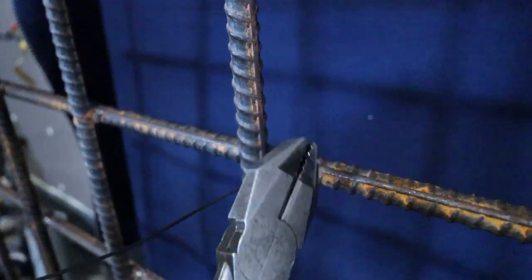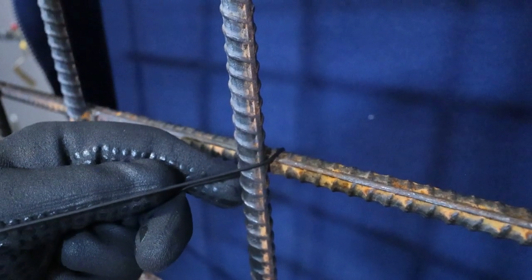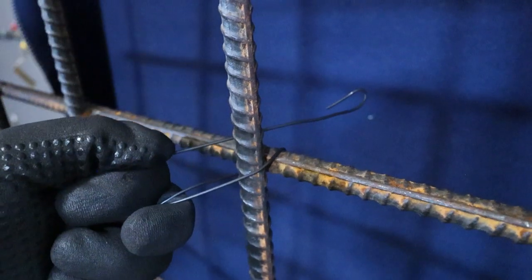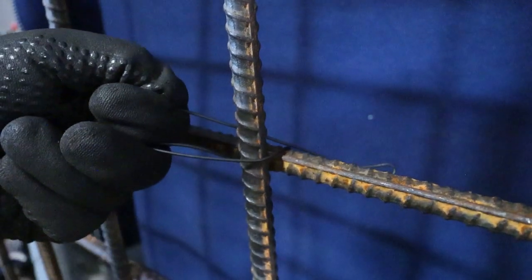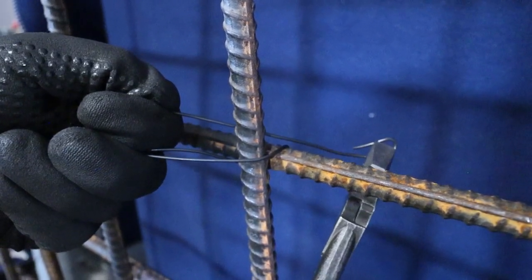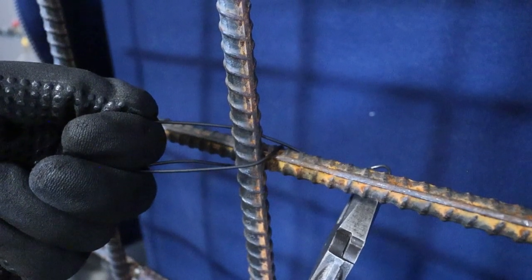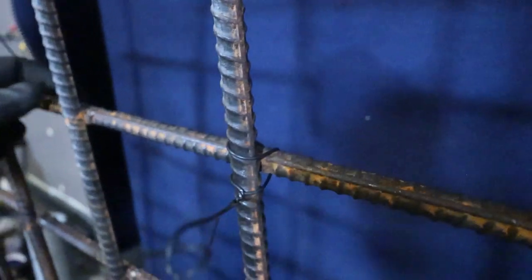Now our back X vertical. We're going to enter in quadrant three, exit quadrant one, pull yourself again about 8 or 9 inches. Another tug, get it nice and tight. Next, we're going to stab into quadrant two, but again, we're going to have our pointer finger make us a bend. Boom. Now you can manipulate your wire a little bit to help it go into quadrant four, because that's where you're going to grab your wire. Now, just pull, and don't re-manipulate yourself anywhere else. Just pull again, and just let the wire slide off your finger. Boom. Get back into your snap. Back X vertical.